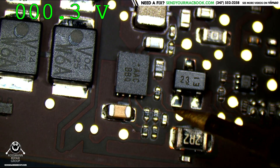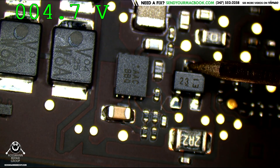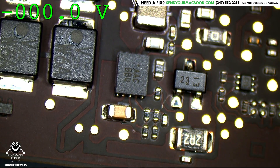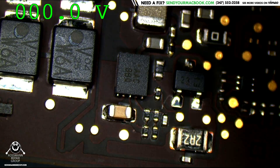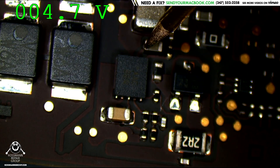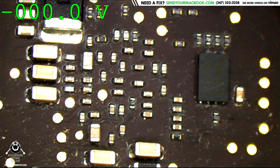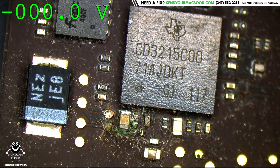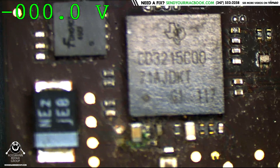That's odd. We've got 5 volts coming in; the diode is going to decrease it a little, which is expected. In rare cases the diode limits current too much so it can't work properly. Right by one of the CD3215s, what I see is corrosion — nasty, filthy, awful corrosion.